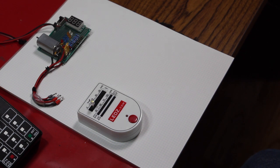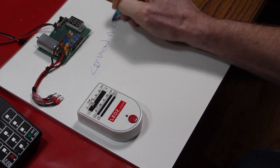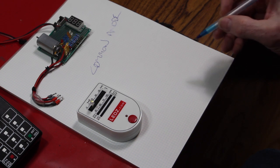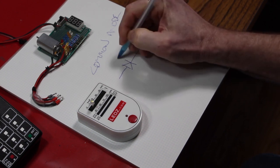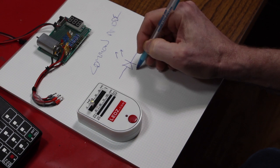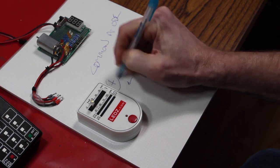An Airwire controller manages lighting effects through a configuration called common anode. And you say, what does that mean? When you look at an LED, it's pretty straightforward about how it works. The symbol is like this, that of a diode, with photons erupting from it. Looking at this, the electrons flow against the arrow in this direction, from negative to positive.